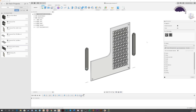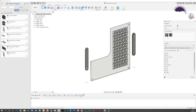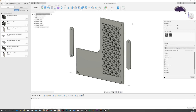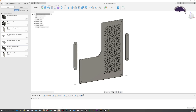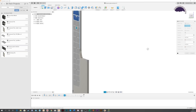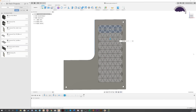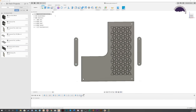One of the reasons I chose eight millimeter acrylic rather than six is because I was worried it might not be strong enough during machining — putting quite a bit of stress on the material. If I got halfway through this quite big job and something snapped, that'd be risky, so let's just go with eight millimeters. In terms of how I actually made this: I used a sketch to draw the first row of triangles, then used the pattern tool to bring it all the way down. I did exactly the same on the other side, extruded them down, and left 0.5 millimeters of stock between the two surfaces.